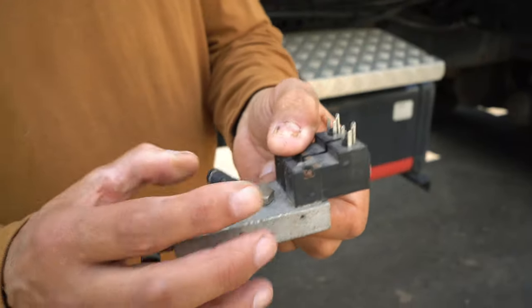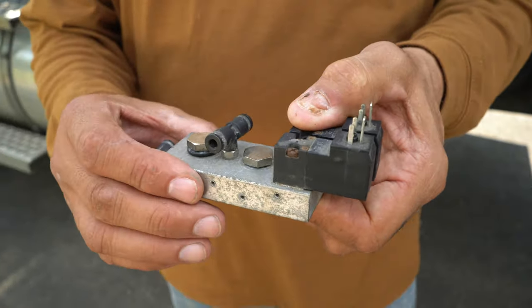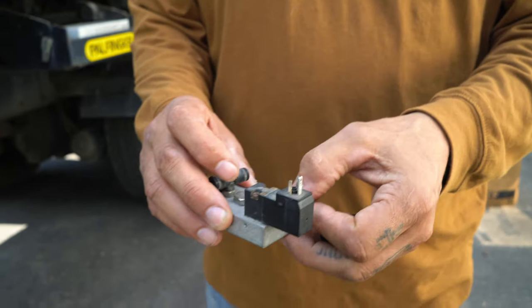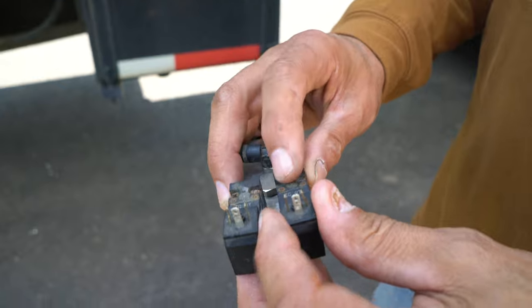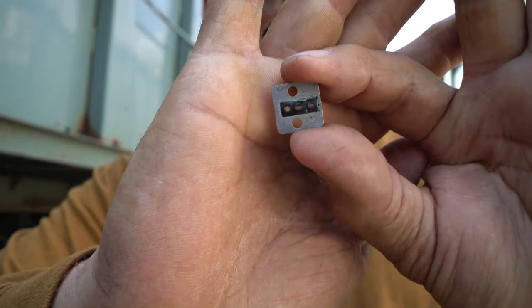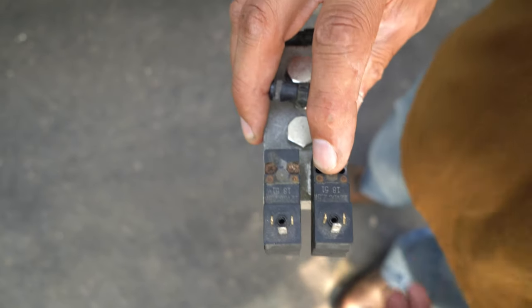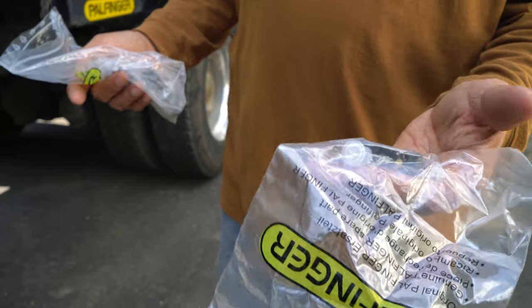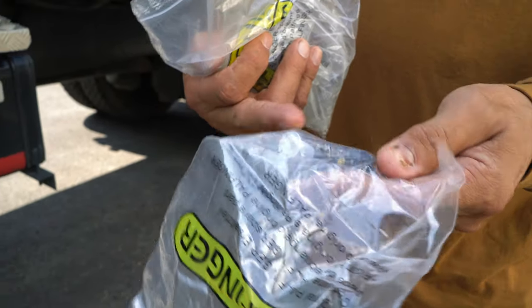Chuck was right. What happened was last year this happened to me and it wasn't working correctly, so I just bought two whole blocks — it cost me $500. Now Chuck's like, 'Hey, it's just the washer — come by and I'll replace it.' If you notice, this is an aluminum block and this is an aluminum washer — it goes in here. You can see the little rubber in there — that's the part that goes bad, causing a no-go on your hoist. So I bought four spare units. They come with the top and the washer, because they didn't have any washers separately. Now instead of replacing the whole thing for $250, I have the washer and a new control piece.